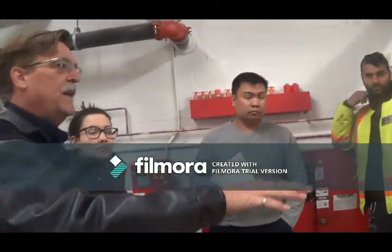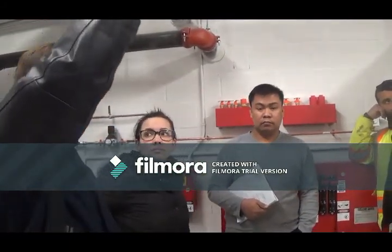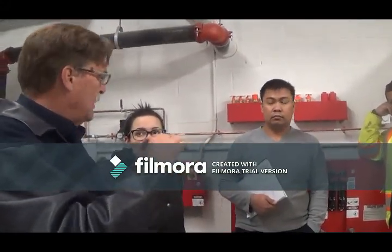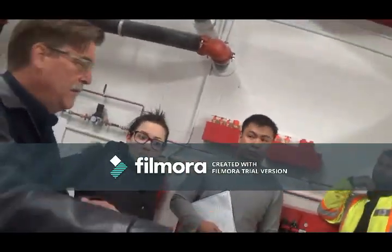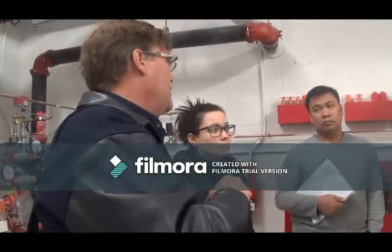A few controls: the set point pressure. There are sensors on either side, so you get city water coming in, and set point pressure in the water on the roof. What it will do is fluctuate the two pumps, whatever is most electrically efficient. You may get one running, and then the second one comes on, and they'll both slow down. The CPU controls this to maintain the set point pressure at the most efficient point, ramping up and down.